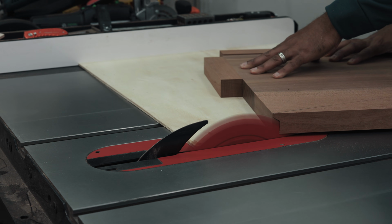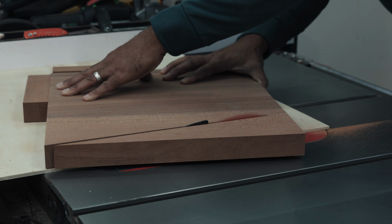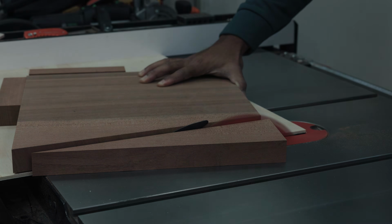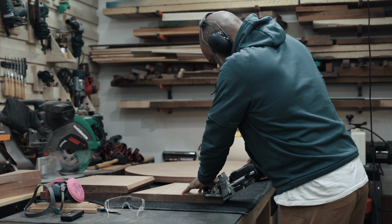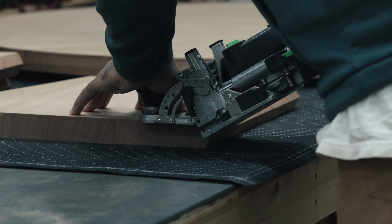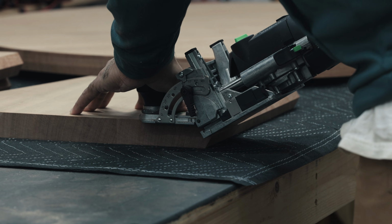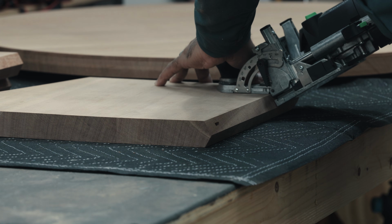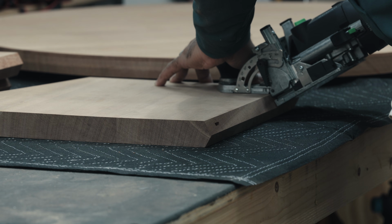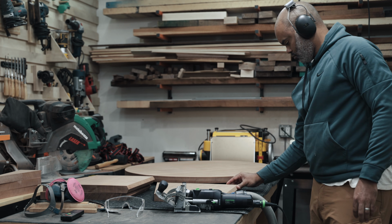But once I do make the cut, I'm not going to get rid of that offcut just yet. And when I thought about putting dominoes in, I wasn't quite sure if I'd be able to fit the 3 legs together once the dominoes were in there. But I went ahead and plunged the mortises anyway. And it turned out I was right. With dominoes in all 3 legs, there's no way I could put these together. So even though I plunged mortises in all 3 legs, I was only able to put dominoes in one of them.